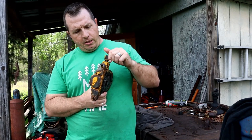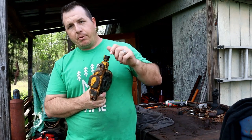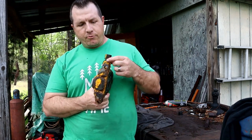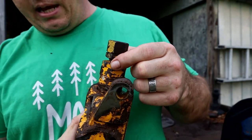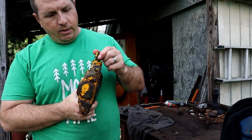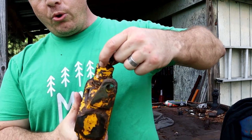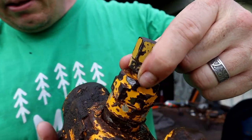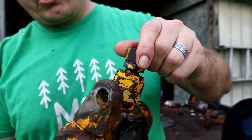And then there's a lower valve that comes up from the bottom that seats in there also. So I was thinking, by going to the manual, this valve body right here, that is contained in this nut here, would be the way that I could figure out my problem. And that is what I would advise. But don't destroy the nut trying to get off of there. It started rounding off two of the corners.